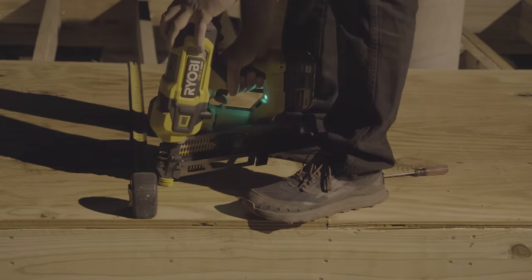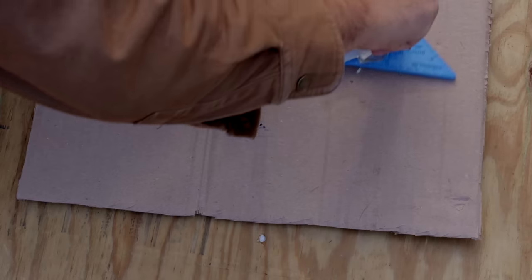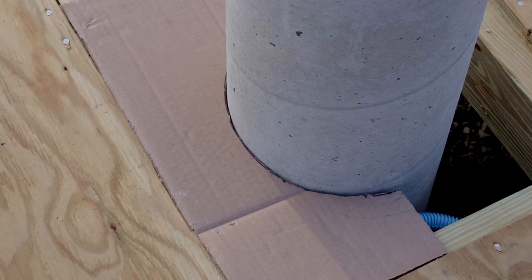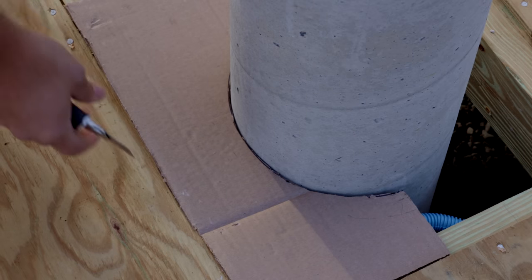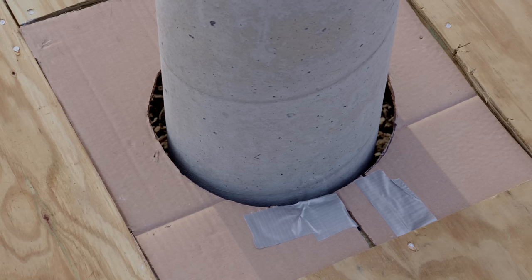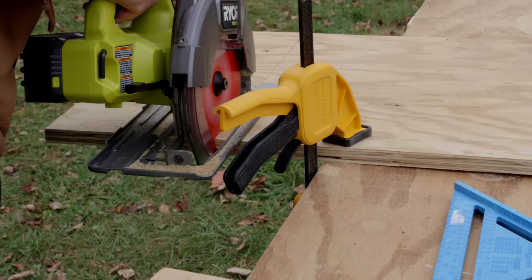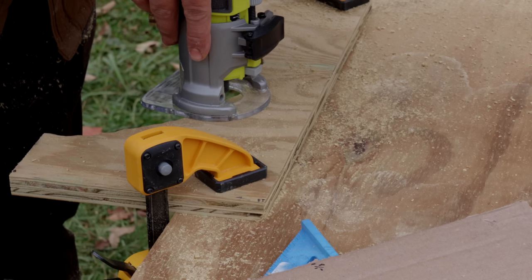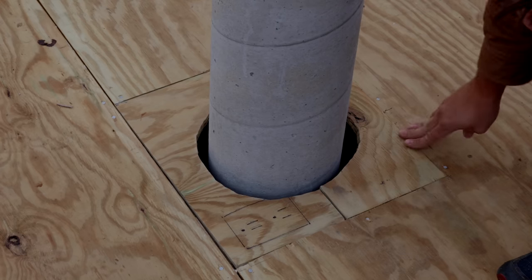When it came time to lay down the second row of plywood, I had to cut out the openings for the telescope piers, and I got so preoccupied with that that I made another mistake: I forgot to stagger the sheets. You're not really supposed to have four sheets meeting up at one point — you're supposed to stagger them, which I did remember to do in the back for the final two strips. But it should have been repeated in the front. I didn't fix this mistake because I didn't think it was a huge deal. For the pier openings, I made templates out of cardboard, then used my circular saw for the straight cuts and a handheld router for the circular cuts.